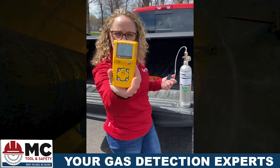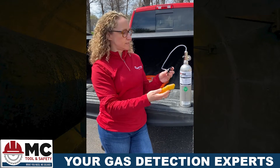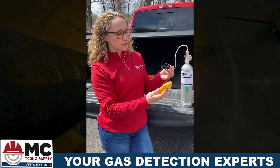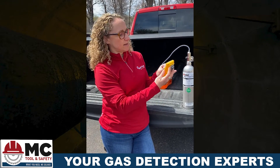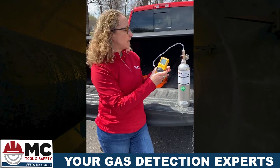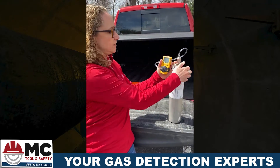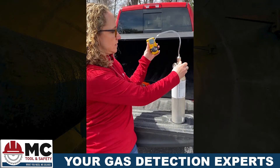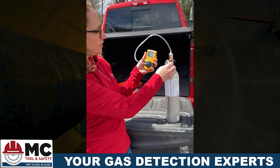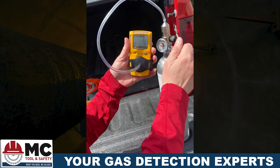All right, so now that it's all zeroed out, you can see it. Honeywell recommends doing this before every use. So first thing you want to do is put your clip on that covers all the sensors. Then you want to turn your gas on. This regulator uses a knob over here. Turn it on and you can hear it. And you'll see all four of those sensors move, so we know that this works.